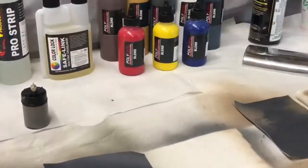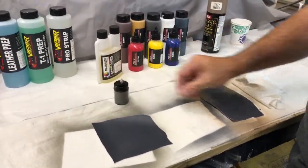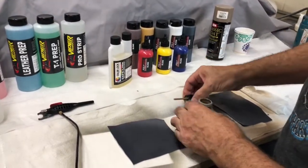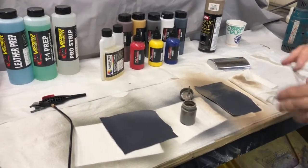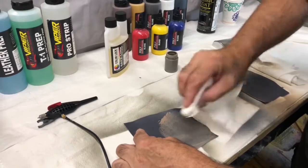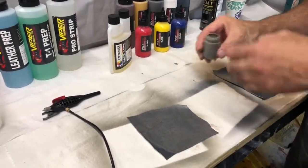Now, if you use a professional product like Polycrill — we have taken Polycrill, mixed it up in a jar, and added our cross-linker, Safe Link, to the mix. Then we're going to take an airbrush. Normally what we like to do first is rub the first coat in. So we are going to rub the first coat in. That gives us the best penetration on the surface and allows the product to adhere very, very well. This is just a light coat to get the penetration.